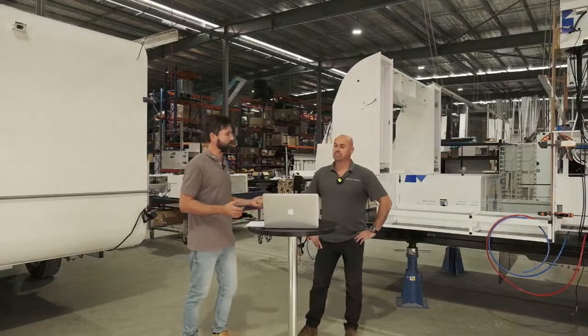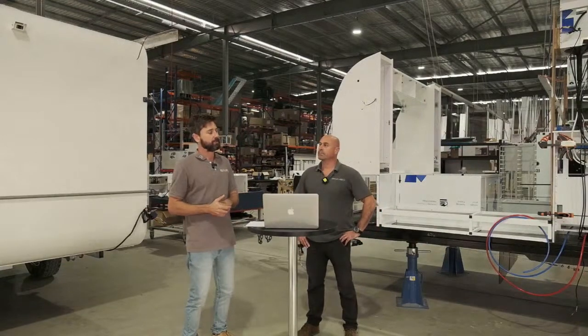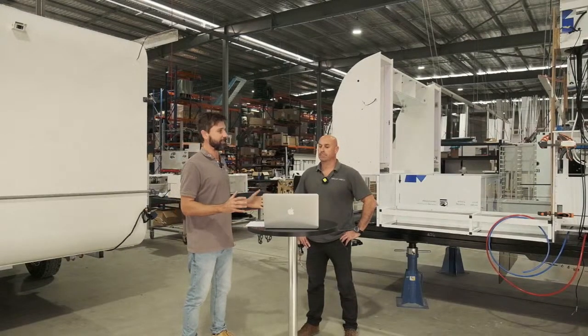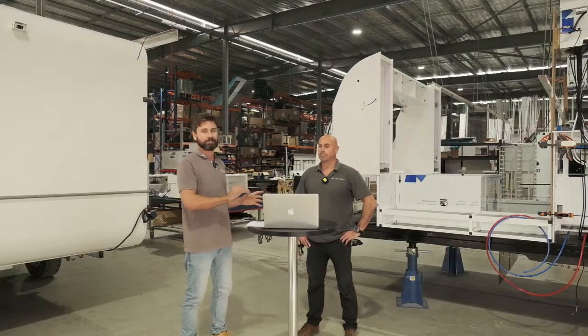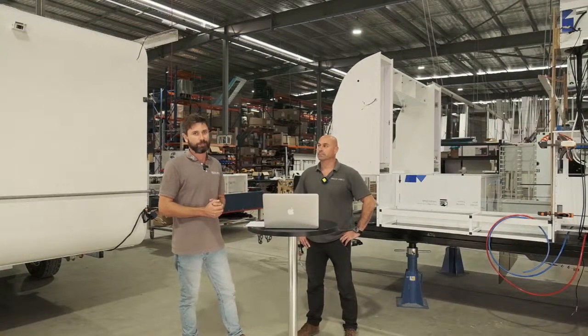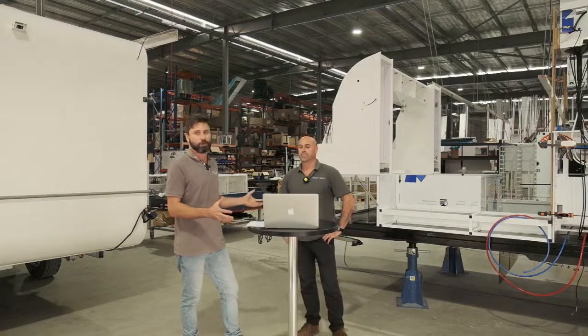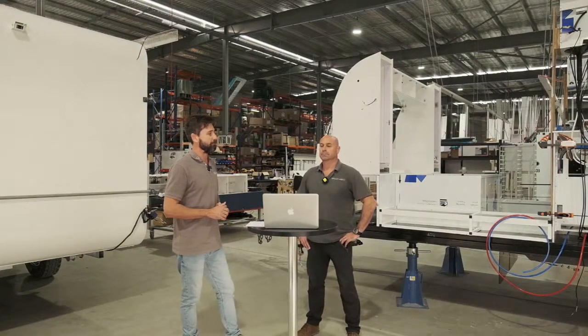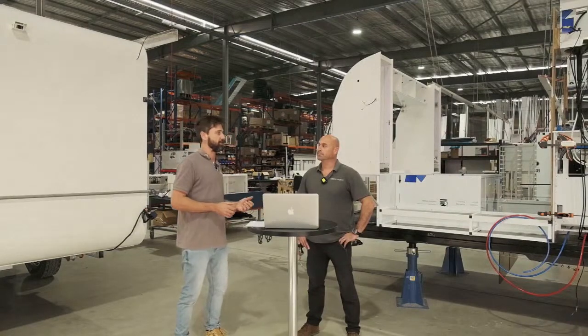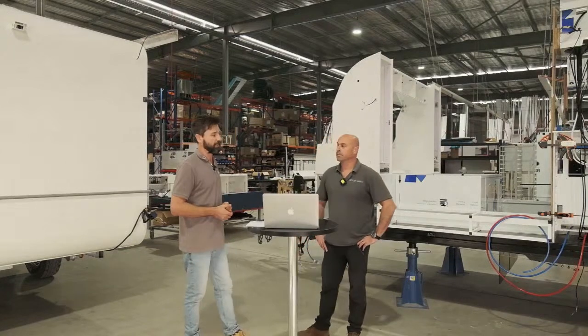And a really good reason for that is we get a lot of people saying, "Oh, can I have an 18'6", but I want the rear door," and it's like, no, I'm sorry, you can't. It's going to push the wheels too far forward. It's not going to be a balanced caravan. And no matter how hard you want one, we're not going to build you one because it will compromise the safety of the van. There's certain things that, in Zone's history, people come along and want changes like that. And then there's certain things we dig our heels right in, and obviously a safe towing van is at the pinnacle of that.